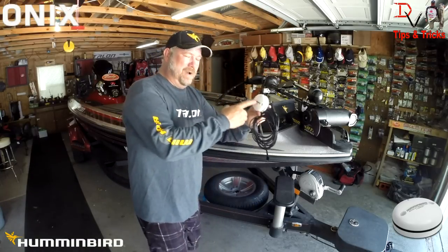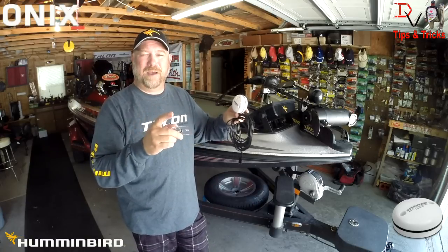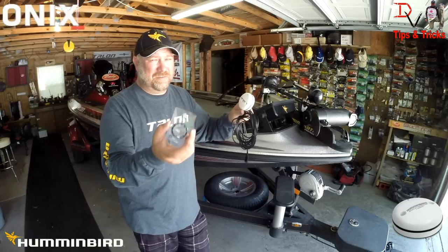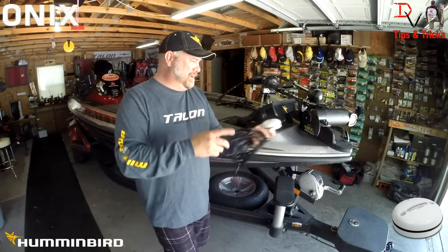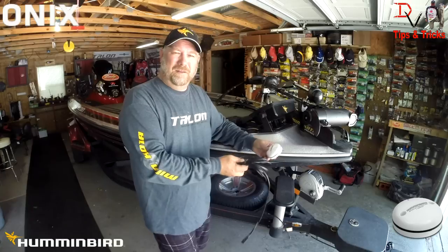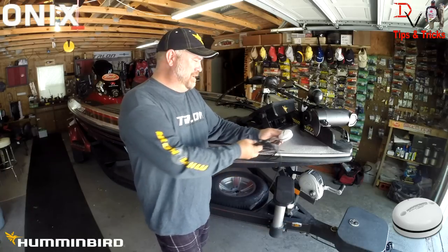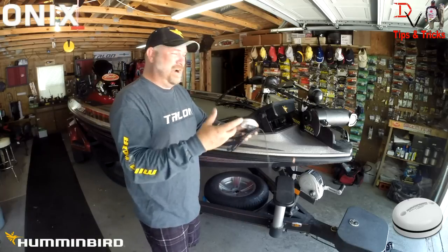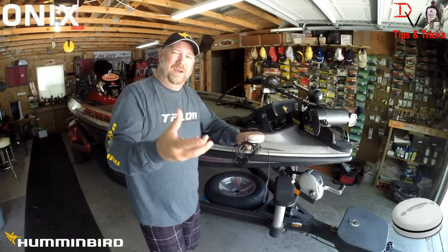I hope that tip of using a compass will help you better position your GPS receiver for maximum accuracy and knowing exactly which direction your boat is pointed at all times. It's a simple thing to do. One thing I recommend on a GPS receiver is get some good double sticky tape and try it first — you don't have to permanently mount it right off the bat. You can use double sticky tape or Velcro and move it around your boat to find where your accuracy level is going to be the best.